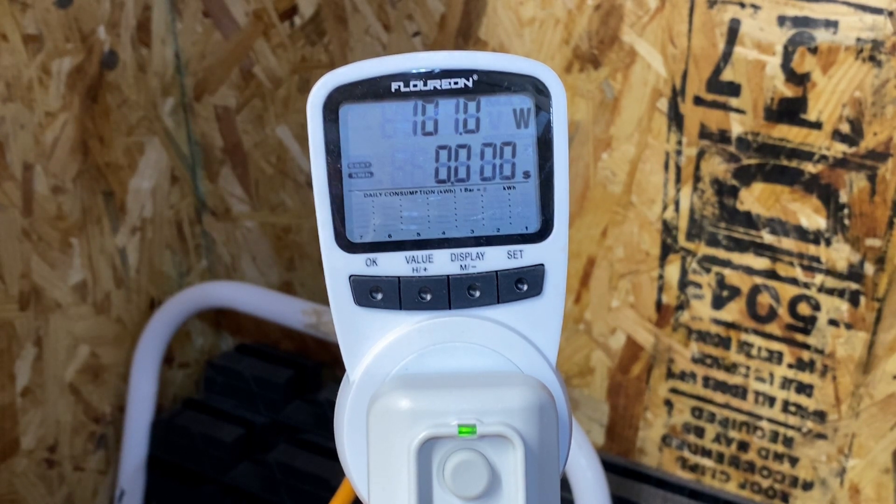The fan just kicked up a little bit — now it's at 101 watts. I think the AC compressor is getting ready to kick on. Yep, there we go: 590, 585, 571 watts. So this is the wattage when the unit is in AC mode and actually cooling the shed. At 560 to 580 watts, I'm still at a positive net wattage with my system pulling about 700 watts from the solar panels and two charge controllers. My hope is this summer, with lots of sunshine, I can stay at positive wattage, keep the AC running, and keep my components cooler than the outside temperature.